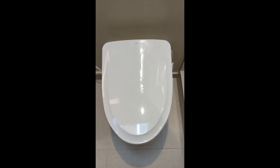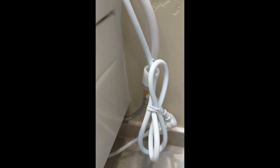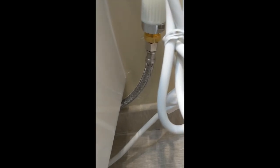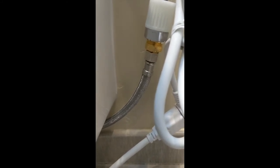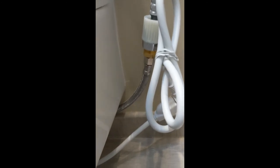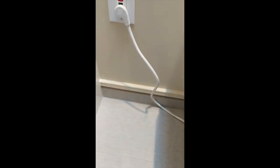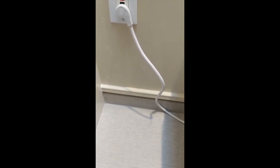I've made all the connections — let's take a look at them. I've got them running onto the right side: you have the hose with the water connection and then the electrical. You can see the stainless steel hose there with the two adapters, and then the dishwasher 3/8-inch line. The electrical — all of that just goes underneath the toilet. On the other side, you can see the stainless steel line running into the back of the vanity.